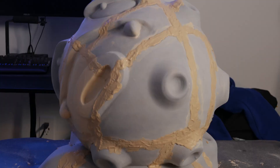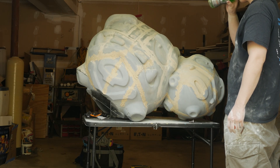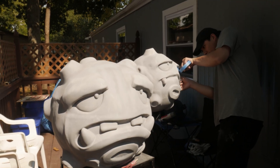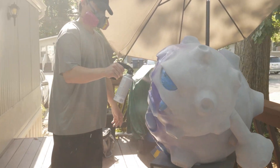Keep sanding until it's flat enough, then apply as much putty as possible and sand it with 220 grit sandpaper, trying to round and smooth everything out evenly. Then do primer. There's a lot of sanding, putty, and primer — but that's literally what the whole project is about. Once you sand with 220 grit, make sure there are no dents or scratches. If there are, add a little putty, sand again with 220 grit. Once everything is completed, coat it with primer as much as possible so the paint sticks on perfectly.